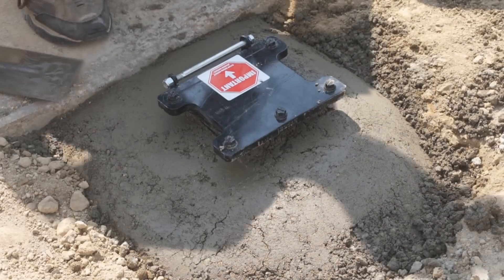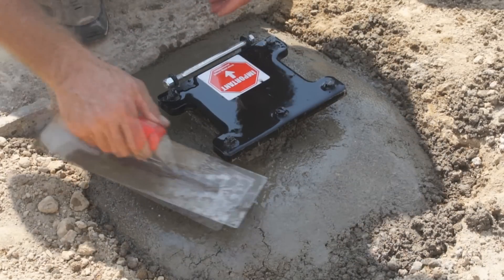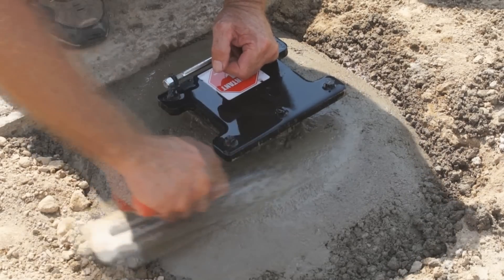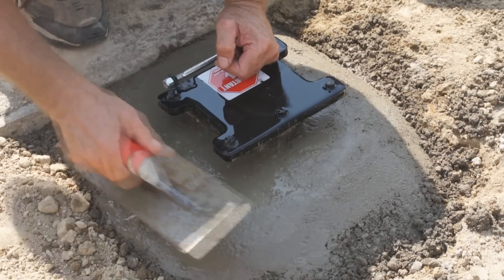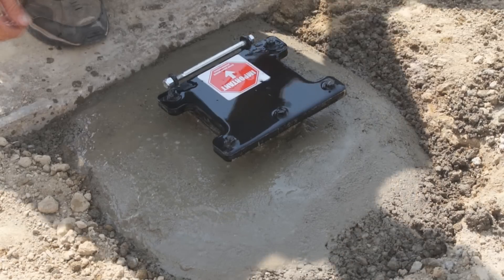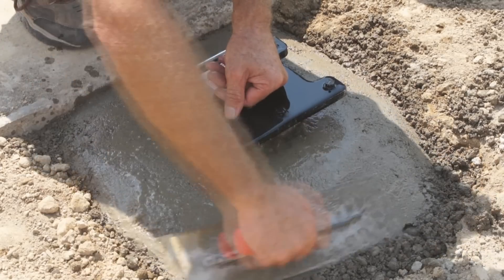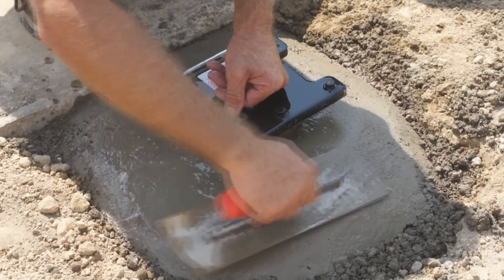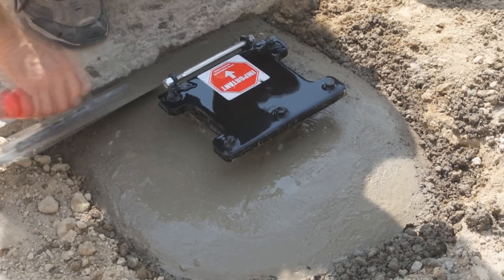What you want to do is take some water and apply it on top of the concrete. Look at how it all just blends in nice and smooth — it'll put a real nice finish on top. You can do a nice cap finish on the top of your concrete. If you need to, add a little more water — that's all you've got to do. Try not to add too much though; just enough to bring it around and put a nice smooth finish on it. Keep working it, just like you're buttering the top of a cake.